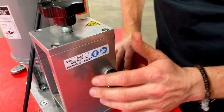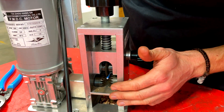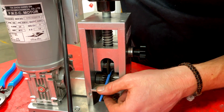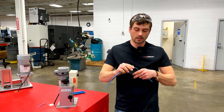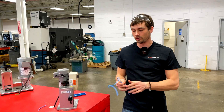The last step is to get your knife set correctly. So what I do is run the machine slowly and bring the knife down until you start to see copper. Now I can crank it up to full speed and we can start stripping. So just to do a little demonstration, I'm going to kink this cable up a little bit and you'll see just how badly kinked you can have your cables while you're stripping.